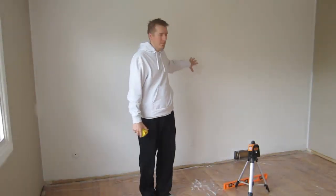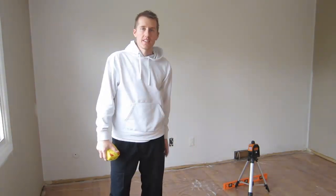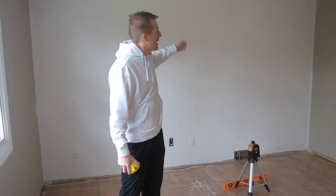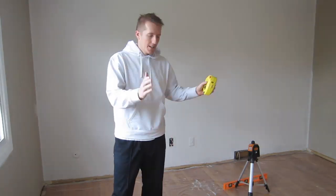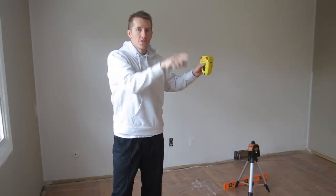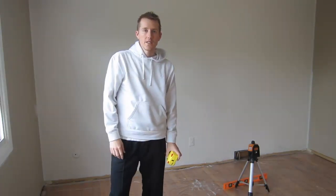So first thing we're going to do is paint the entire wall white. Alright, so we have our wall painted white, and that's going to be the base color of the chevrons, the zigzag pattern. We're going to paint gray stripes. Now, we've watched a bunch of videos, and there's some people that measure each box, draw each line. And then we saw one video where the lady just made a pattern. She determined how big the boxes would be. You make a cardboard pattern and just trace it all the way down, and it looked quick and easy. So that's what we're going to do.